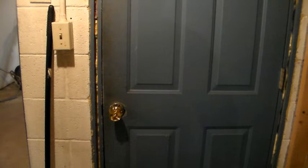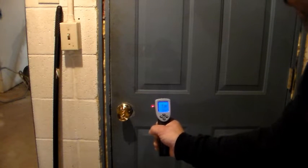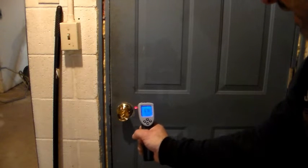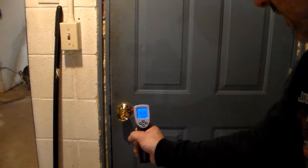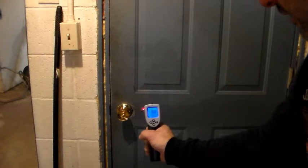If we wanted to measure for air leaks around a door or window, we would go back to where the two dots meet and measure that way. I'm measuring about 71 degrees on the steel entry door. There's a gap around the door handle because it's not adjusted properly — we have an air gap there — and it immediately drops down to about 60 degrees. So I can see I have an air leak there.